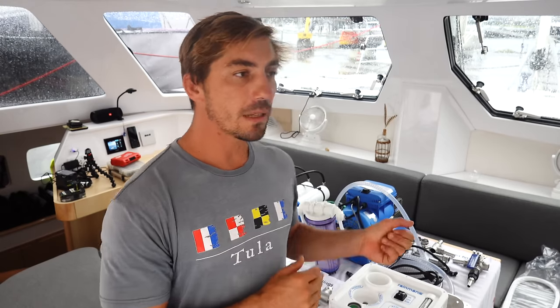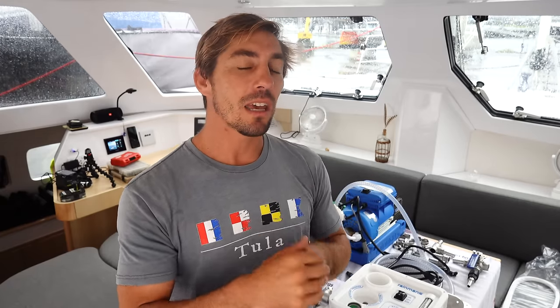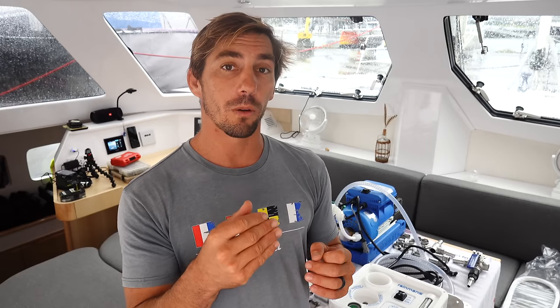And a big advantage that most people don't realize with AC powered water makers is not only is their production rate a lot higher, I quoted 26 to 37 gallons per hour for this unit, which in the Caribbean on Adrenaline we were seeing 36 gallons per hour pretty consistently. It really depends on how warm the water is. The warmer the water, the higher the production rate, as well as how clean the water is, things like that. But in short, we made a lot of water really fast, and that was really nice because we only had to run the water maker a couple hours, like once a week, and we had all the water we needed.